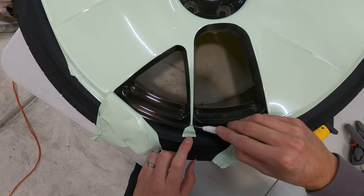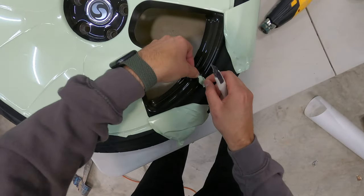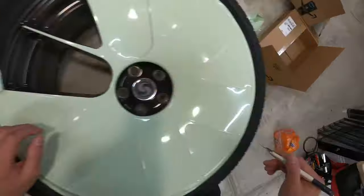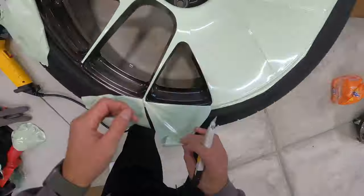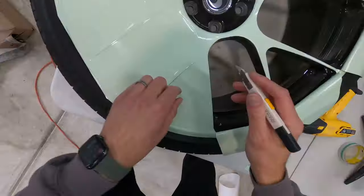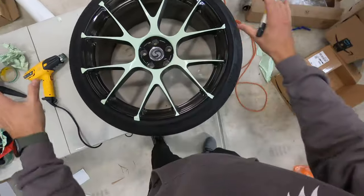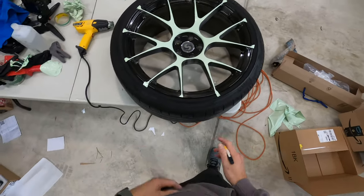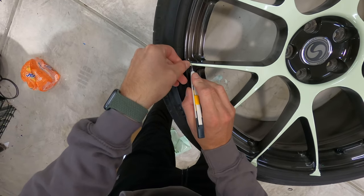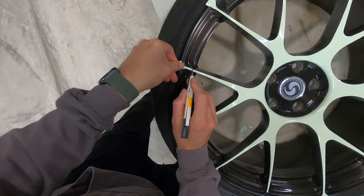As I get to the side I want to pull some tension, then come over here for better control. I want to get in the same spot each time — starting up here, going inside, dragging my finger behind it, then rotating so I can grab the other side and get tension in to finish the cut. It's just a light scoring of the vinyl, not cutting through it — scoring it so we can pull it straight.